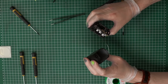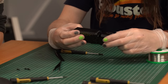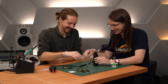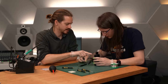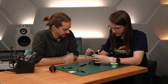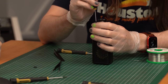Now if all is good we should be able to make the two parts mate — the capsule should point in the same direction as the logo on the product. Align the XLR hole with the corresponding hole, like this — this is the front. Everything should just slot in like a glove. The largest screw goes in to lock the XLR connector into the barrel, then you need the hex key. This is another point of electrical contact of course. This feels really satisfying now — it really looks like it's done.